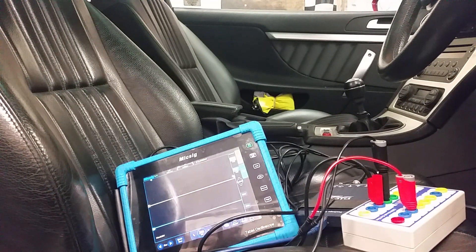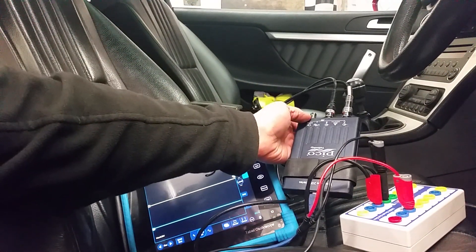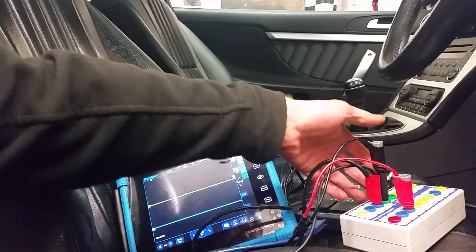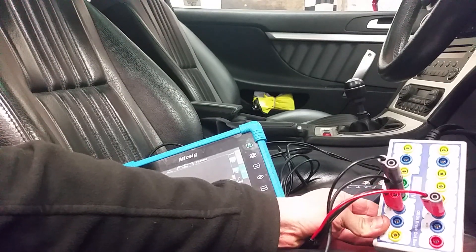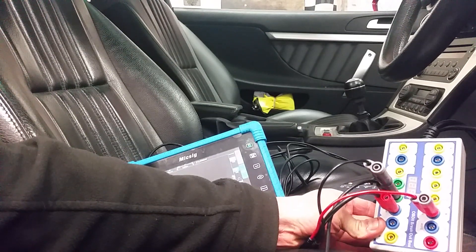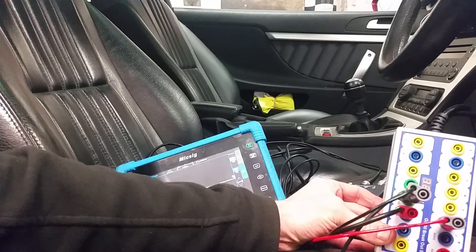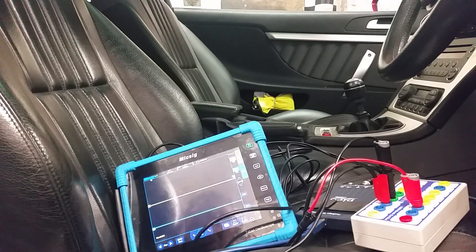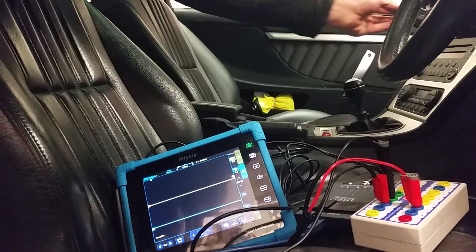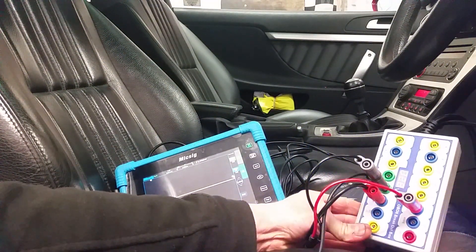You can jump about the settings all in real time, so you can adjust it very easily. I've got the Pico 2000 series here - the home starter Pico which is a great job. A lot of guys that subscribe to my channel have one and use it. We've got this breakout box connected in the DLC there, with four millimetre bananas plugged into the CAN high, CAN low, and the two negatives piggybacked on the signal. There's some LEDs, and our test subject, the Alfa Romeo, is having a wee sleep. So if we just put the key in the ignition - there's the breakout box flickering away with the CAN high and CAN low.